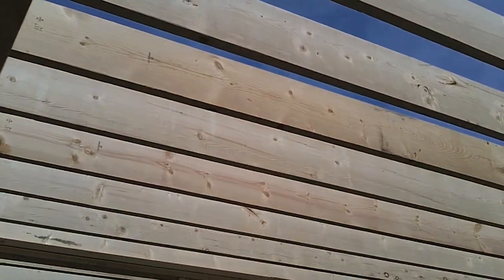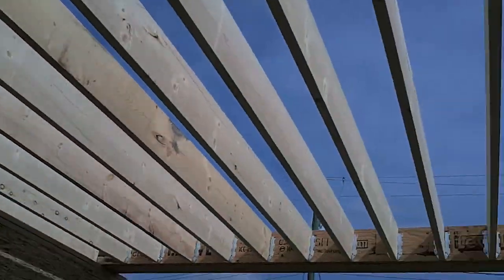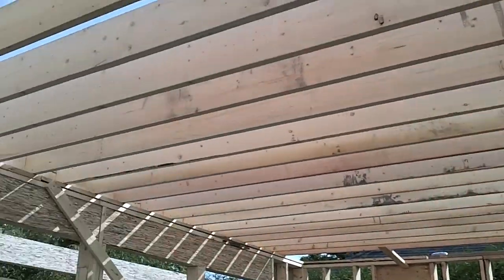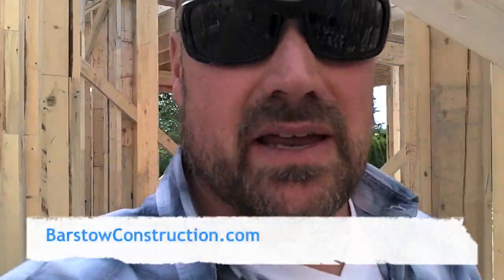What that does is, over the years as the house settles out, that wood will generally settle to flat as opposed to dip. So we want to put our lumber in crowned like that. All these pieces have been crowned — every last piece of wood that goes into our ceiling, all the way through our house. That means less squeaks, less dips and dives in the floor. It's just a better way to do it. Not everyone does it like that, but we like to do it, and it makes for a more solid, quiet house in the end. It really doesn't take any extra effort — it's just one of those things we like to do.